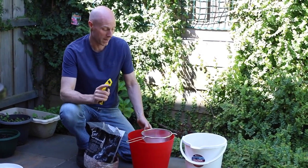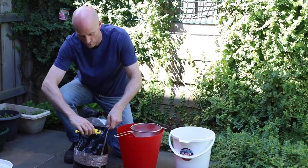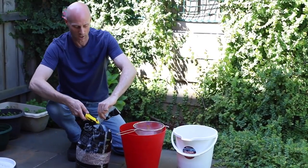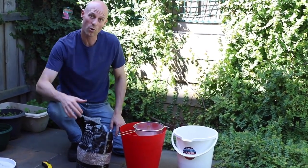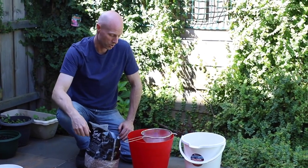A lot of people have recommended, and I'm now recommending as well, that you actually just run your pellets through a sieve, because there's a lot of dust that goes through you don't even realise. It accumulates in the auger and feeds through that pipe into the fire pot, and that's where that back burn can occur.